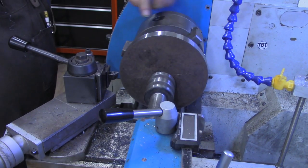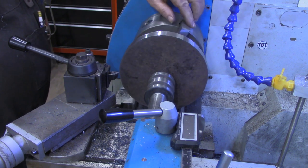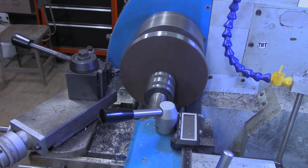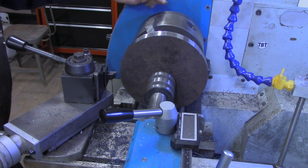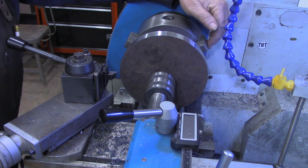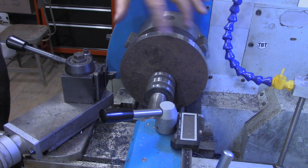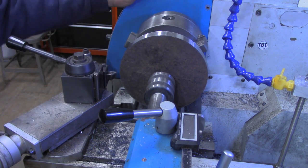Okay, I've got the outside of it now cleaned up all the way around. I'm going to make one more final pass on it. This has been a very hard edge on here. What I'm going to do now is use acetone to release this glue back here on the back. Then we're going to put it in the three-jaw with the outside jaws and try to face it off and bore out the center. I'll bring it back when I get this off.